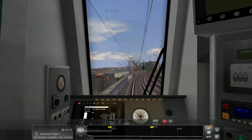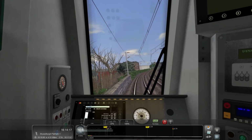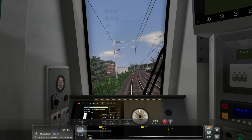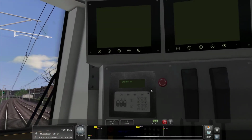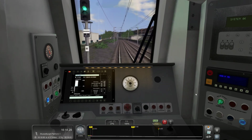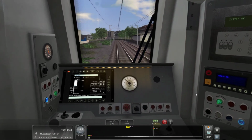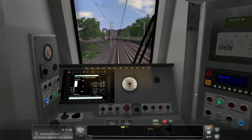To exit the cab seat in an emergency, place the train brake into emergency by operating the emergency stop plunger located on the driver's right-hand side on the movable wall, which is the bit to my right you can see now. So that will be this one here. And this movable wall we'll get onto as well. Use your legs to push backwards and allow the seat to pivot rearwards, swivel the cab seat and exit the cab and move to a position of safety inside the coach.